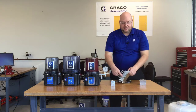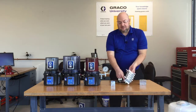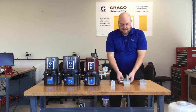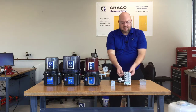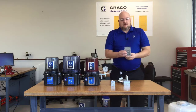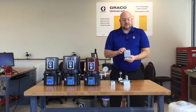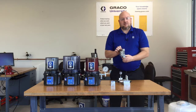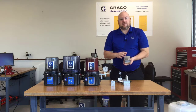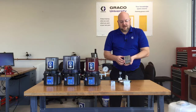The lubrication outlets are along this side. This can all be reversed — these could be the outlets and the other side could have the plugs — but this is set up for a quintuplex because it has five outlets. Three sections can be set up for a triplex or a quintuplex: three single-outlet sections would be for a triplex, while two twin outlets and one single outlet gives a total of five outlets for a quintuplex.